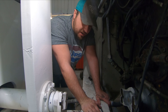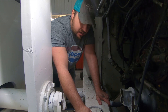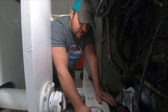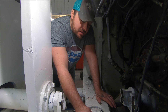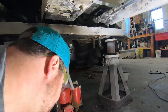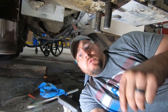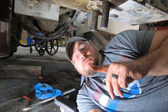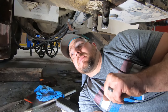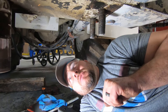Driveline's removed. Now I can push the pin out. I'll jack the tractor up, support it, put a jack underneath the pin, and hopefully — keyword — hopefully the pin just comes right out. I've got a big feeling it's going to fight me. I went ahead and took the grinder with a sanding blade, smoothed off all the rough edges, the high spots, the swelled spots that I could notice by eye, which is probably not that great, but I believe it'll pop through a little easier.